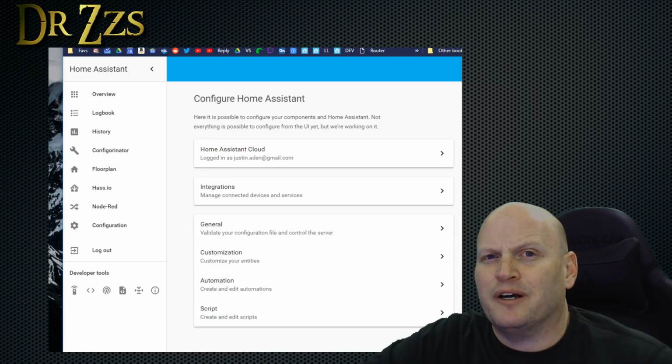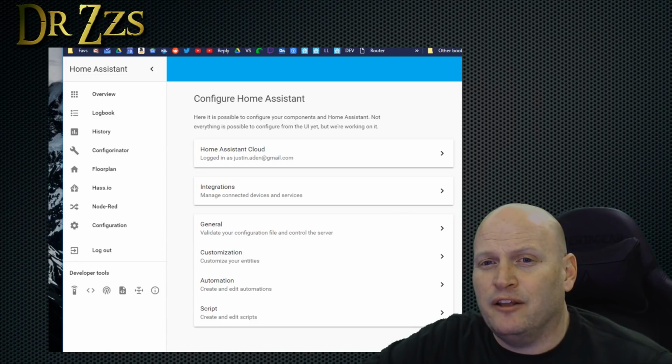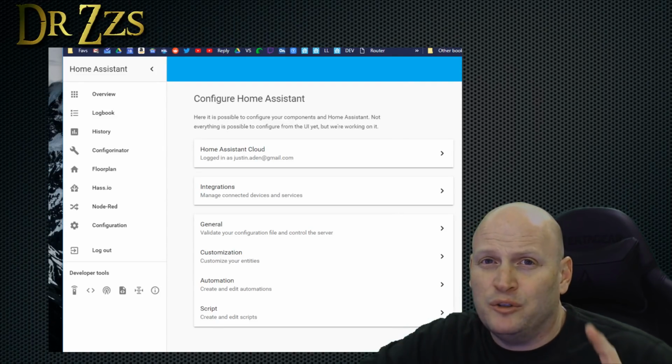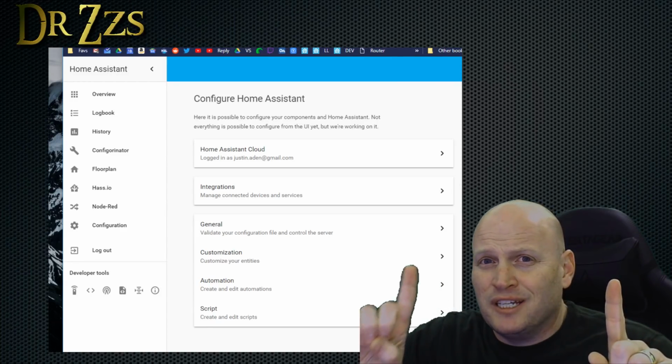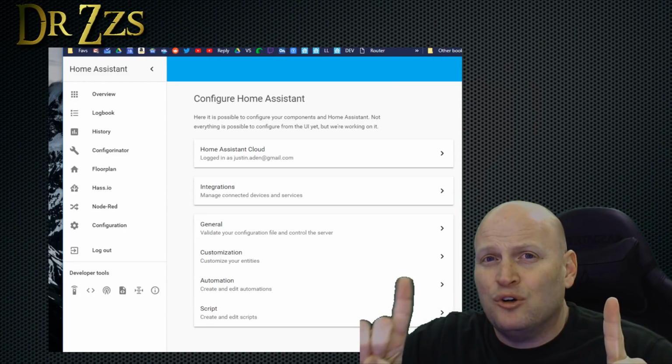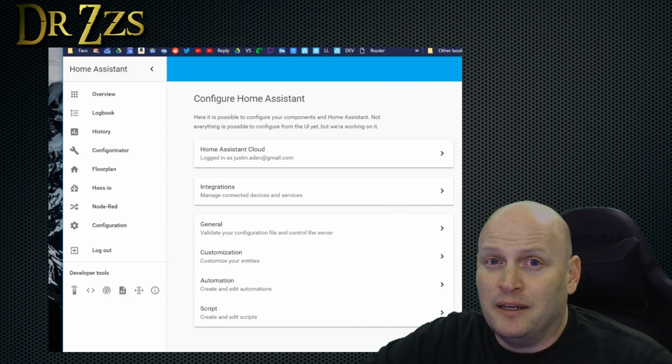And then you can hook up relay modules as well. And switch 1 will control relay 1. So you set one GPIO pin as switch 1, and then you connect a relay to a different GPIO pin, and you call that GPIO pin relay 1 in Tasmota, and it works.